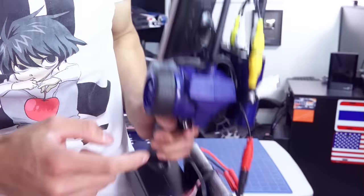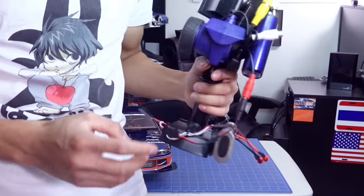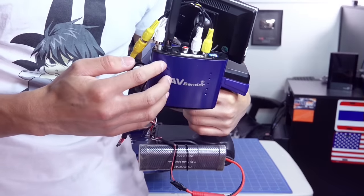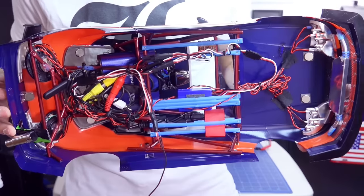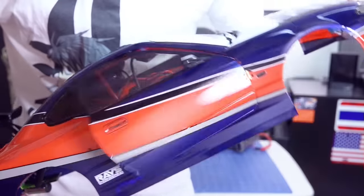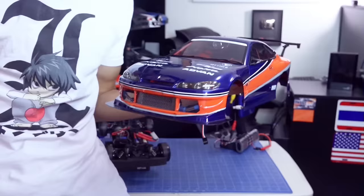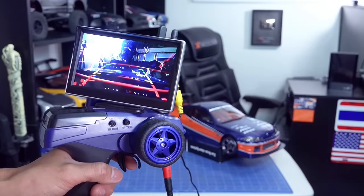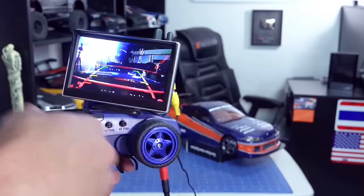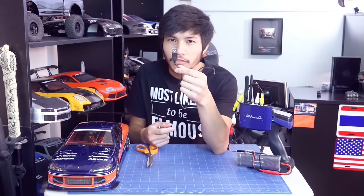I got two switches, one for the monitor and another one for the receiver. I need to have a converter from 7.2 volts to 5 volts before I can connect it to this unit, because this unit requires 5 volts. Everything is fine unless you reverse it and then quickly move forward. And here is the converter from 7.2 volts to 5 volts. Remember the USB that we cut off from the speaker?